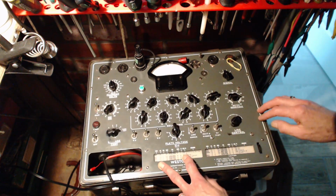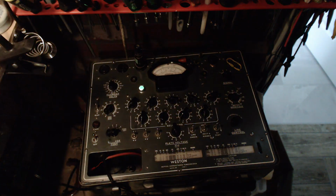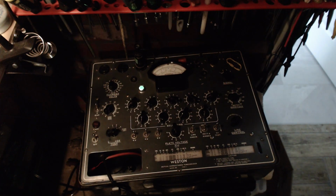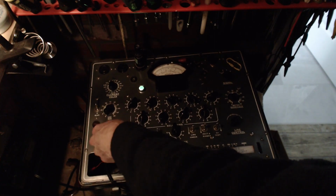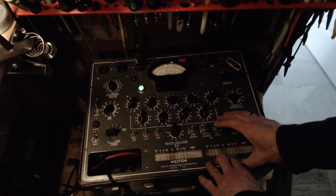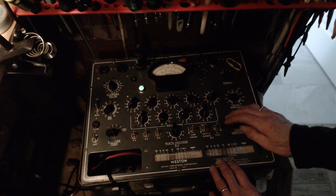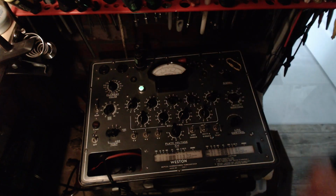Okay. Just give that everything a moment here. Very hard to light my tube tester so you can see the dial. Okay, let's look for shorts. The short test to some degree is protecting your tube tester from a shorted tube. Nothing showing up. 800, here we go. Well, it's up around 1100, well over the 800. Okay, that's not helping.